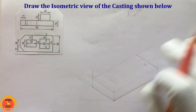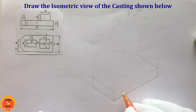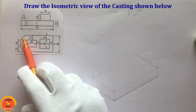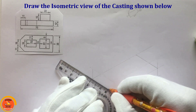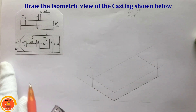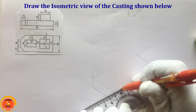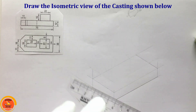Let's complete this. We already know this line is the height — total is 15 and 27. Let's draw the views here. If you look at the top view, the spacing is 11, then 16, then 11. Just keep it in the top view and mark these points. Here is 11, and here is 11. If we have a reference edge here, here is also 11. This is a rough line.